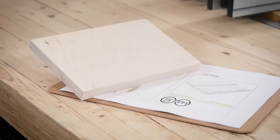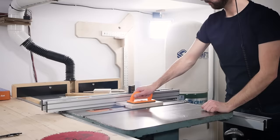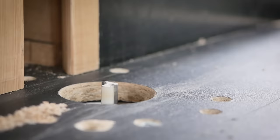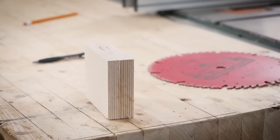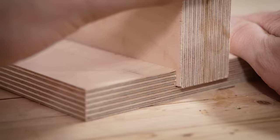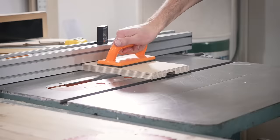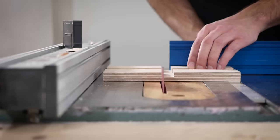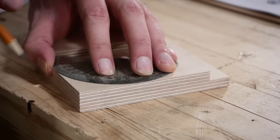I need to cut a couple of dados in this piece, which is actually two different parts that make up the guard, but I strategically left them as one piece in the cut sheet so I can cut two dados at once. You can use a dado stack in your table saw or a router table if you live somewhere where dado stacks are restricted. This dado needs to be the exact same width as the laminated guard part — be careful, because three quarter inch plywood is definitely not three quarters of an inch, so use the part itself to measure the dado width. After splitting into two, the last dado magically transforms into a rabbet and the first wide dado lines up perfectly between both pieces.